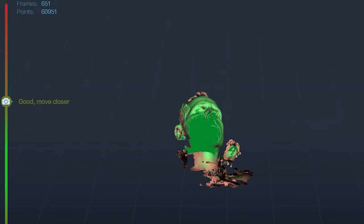I got my son to scan me and he got the hang of using the scanner on his first attempt. It's far from perfect but the final model looks pretty good. You can use the editing tools in point cloud to clean up the model, and if you switch to manual settings you can try to add more detail by lowering the resolution to 0.3mm. If you want a smoother mesh with less detail, Creality recommends 0.5mm resolution. If you want to 3D print the model, under mesh click Fill Holes and Closed. Just quickly — if you are finding this video interesting or helpful, please do consider subscribing to my channel.